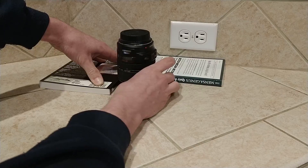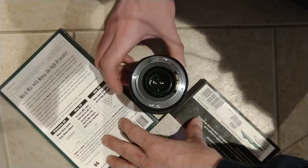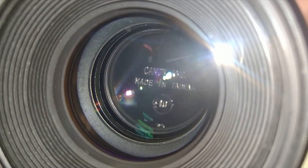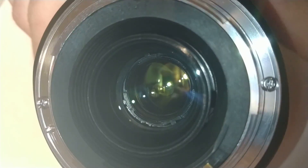In a normal lens, if you keep your lights steady and your head really still as you spin the lens, the lens flares reflected off the lens shouldn't change at all — you should see them in the same exact position no matter how you rotate it. This makes sense because all the optics in a lens are symmetric around the center. However, if you have an element knocked out of place or tilted, you can see a little flare of light belonging to the out-of-place element orbit around as you spin the lens.